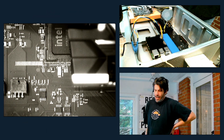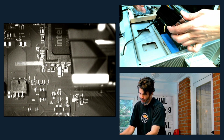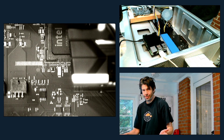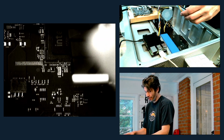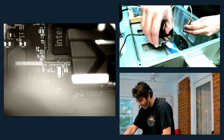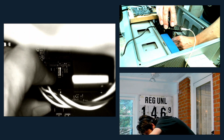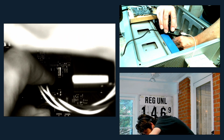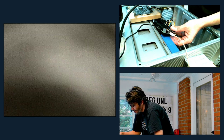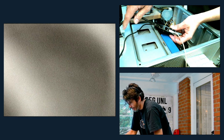So I spent a little bit of time and put together this clip on a Raspberry Pi 3, and I'm trying to use that to, for starters, read the ROM chip on the board, and figure out where to go from there. So what that looks like, just putting this clip on the board. Make sure it's snug and well seated. And then we'll just fire up this machine and see what it looks like.